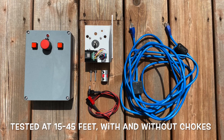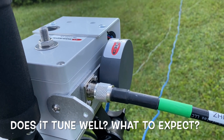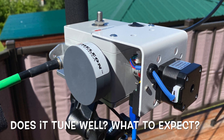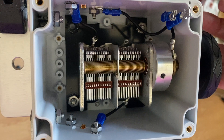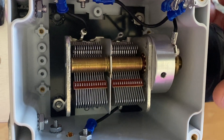This allowed us to reach 45 feet distance so far. The kit works very well and I will make a video just for you on that topic later. But for now, let's look at how well the power compensator can handle a 30 watt CW signal. I was initially not comfortable putting 30 watts full-duty signal in my F-Loop 3.0, but I did trust Chameleon.